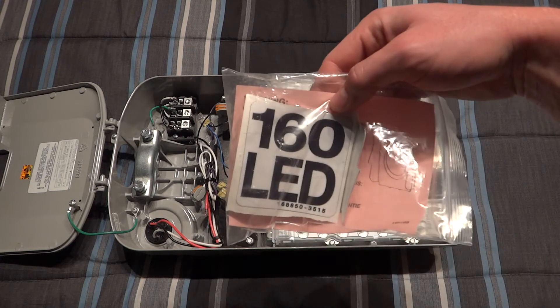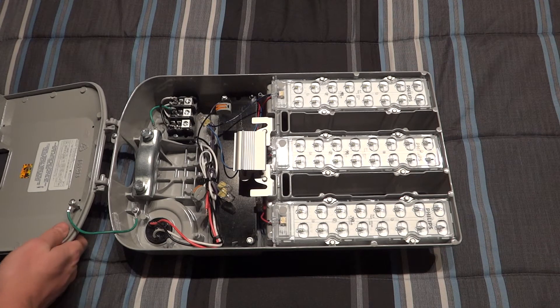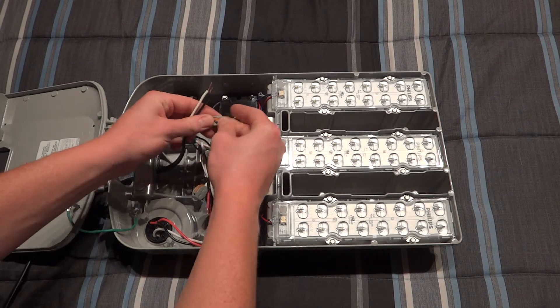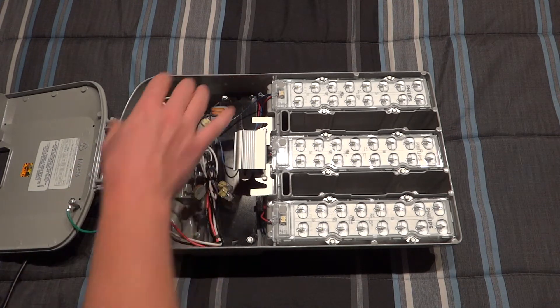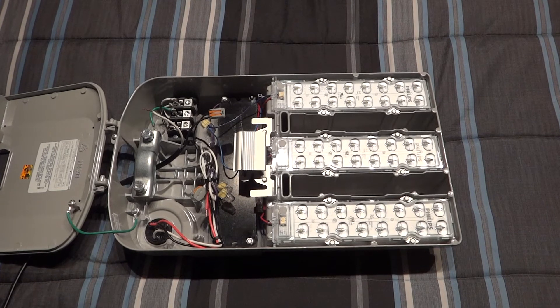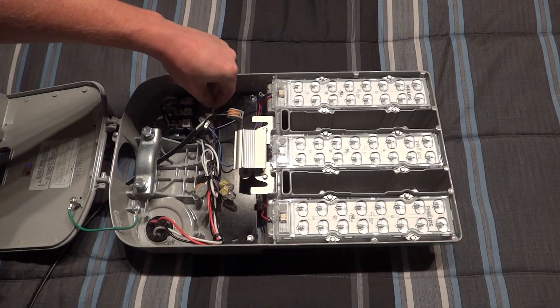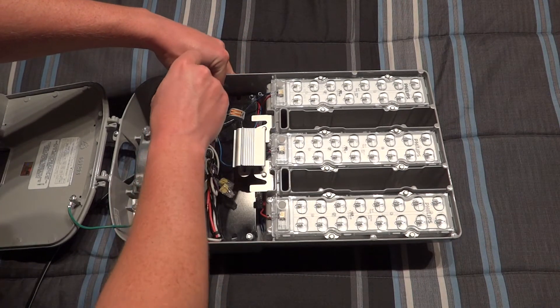This thing is 160 watts. I wonder if it replaces a 250-watt high-pressure sodium - it very well may. But I've also seen these installed in replacement of 400-watt high-pressure sodium, so it could be as bright as that. I got my cord here - it's not really the best cord that should be used with this, but it's what I have on hand. We'll put it in there and this one will be clamped down.